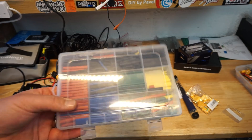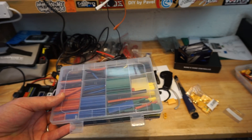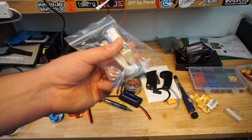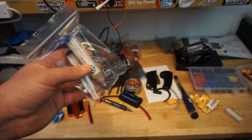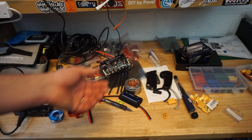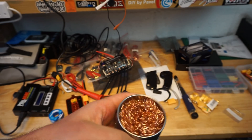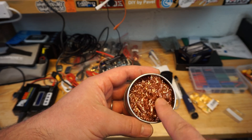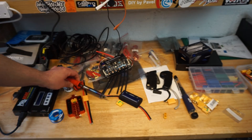You will definitely need some heat shrink sleeves — quite nice after you finish soldering bits; you put it over, warm it up and it shrinks. Makes it look nice and safe. For soldering, I do use a soldering acid — it comes in a syringe so it's quite precise application. Quite handy to also have an iron cleaning kit — it's just copper shavings, and when your iron is hot you rub the nose inside to clean it. That makes soldering much, much easier.